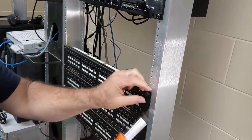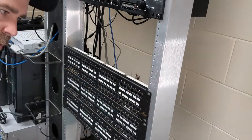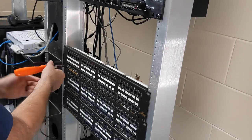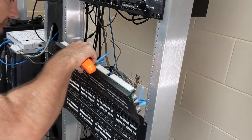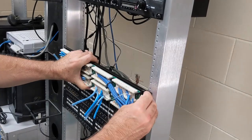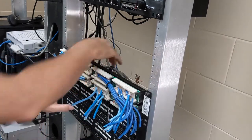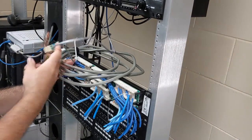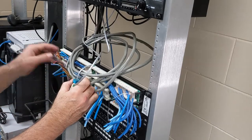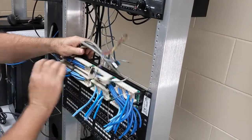To make my life easier, rather than crawl around in the tight space, I'm going to take this panel and turn it around so the terminations face me. These are used panels I got from somewhere, so they need some cleanup — they still have tails on them from when they were de-installed, a bunch of Cat6 and Cat5e cables. I'll spend a few minutes pulling these off, then take this Amphenol 25-pair and fan it out.